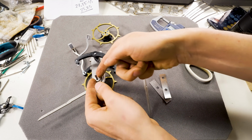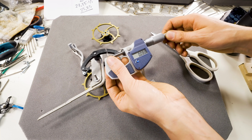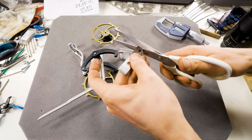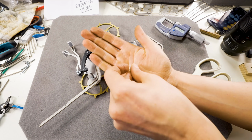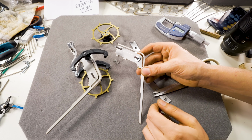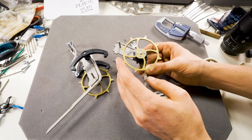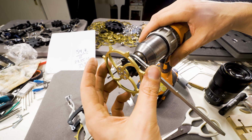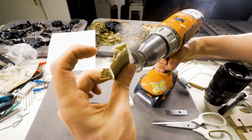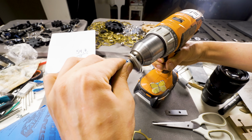On this axle, I had a little bit of play. So I'm going to try to use very thin shim stock. These are the timing shims for the marble snakes. 1/10 of a millimeter. I'm going to cut a shim washer from this. Then one normal washer, my shim washer, another normal washer, the gear, and that looks really great. The wheel is not spinning as smoothly as before. I think I scratched the silver steel axle when I pushed it through the press fit. I'm going to try to sand it smooth again. Yeah, that's better. 2,500. Super fine.